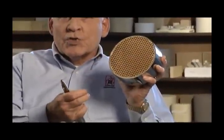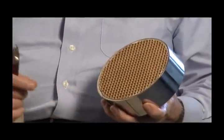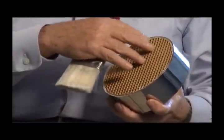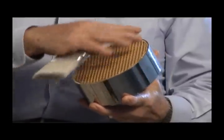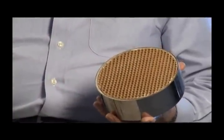If the cells are clogged with fly ash, simply take a Q-tip or a soft bristle pipe cleaner, for example, and run it through the cells. This will free any of the debris in there. Then when the catalyst lights off, it'll burn off any remaining substance left on the combustor. You can also use a shop vac or a house vacuum cleaner to run over the surface of the catalyst to remove or suck out any debris collected in the cells or on the surface.